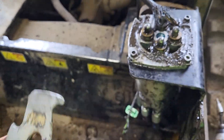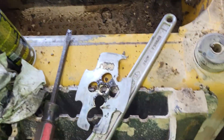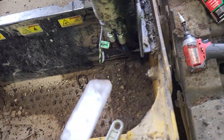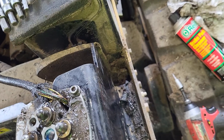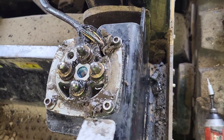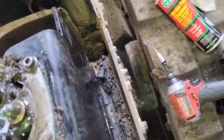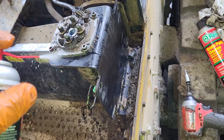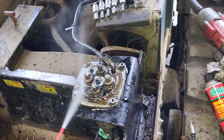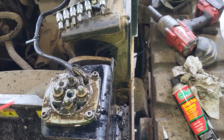What I like doing is cleaning this up. I use just a parts cleaner, a brake cleaner, on this. Get yourself a good scraper — just a little scraper here — and you're going to want to scrape all this. You want to make this really, really clean before you take any of these poppets out. You'll need a handful of rags and probably two cans of brake cleaner. I like using the O'Reilly's generic brand.